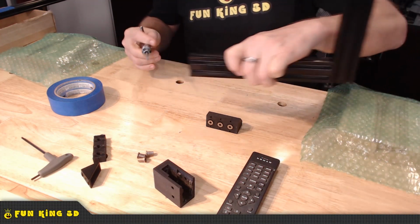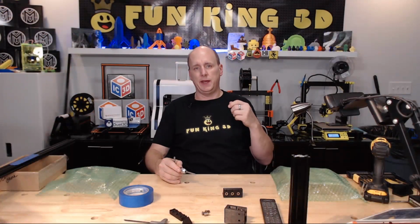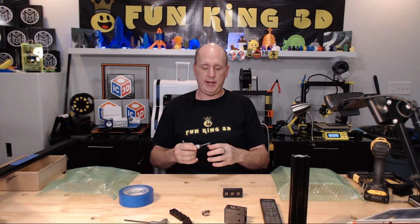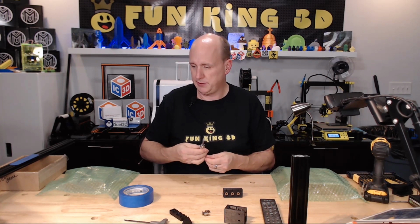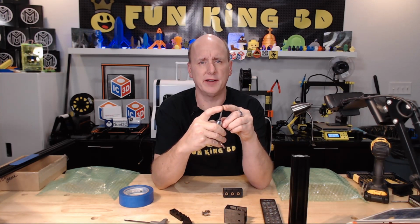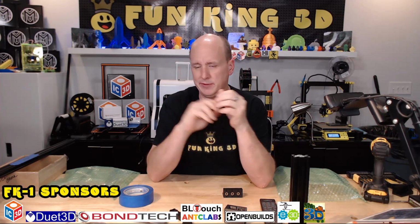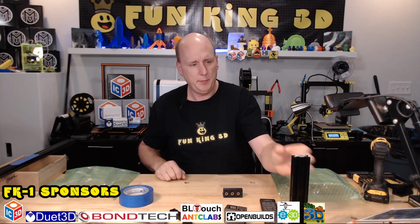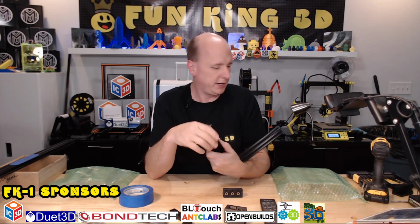Now, if you're only running, say, a 10 millimeter or an 8 millimeter screw into there, then it's probably already going to be enough. I went ahead and tapped everything to the full depth of my tap just so that I would not run into an issue. Because as you thread it in, the end here isn't a full thread. So if you only tap it exactly to the depth you need, as you run that screw in, it's going to bind up in there and it won't be good. But that's a good easy way to go ahead and tap all the ends of your extrusions.